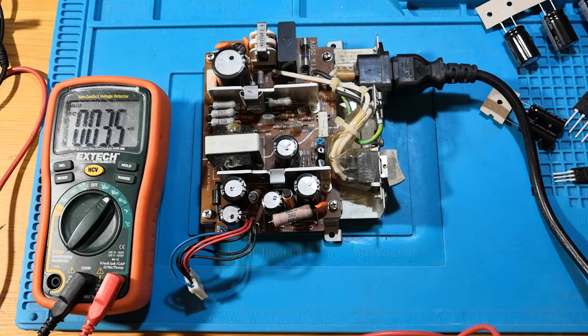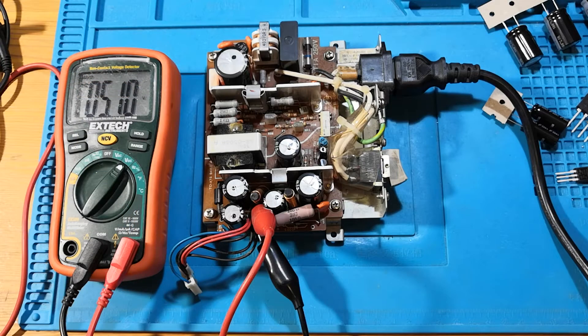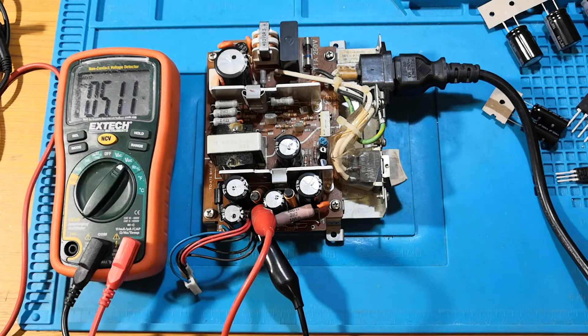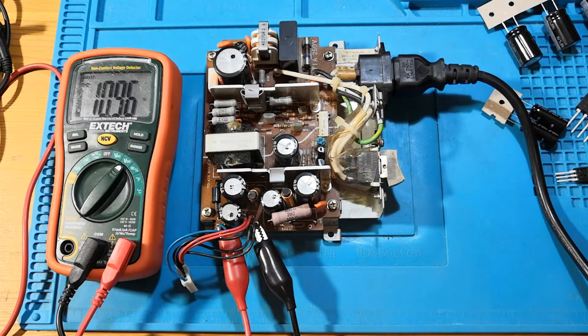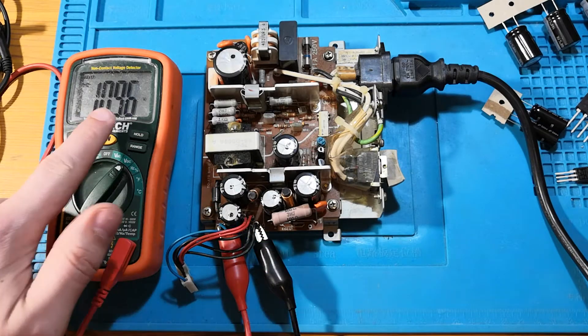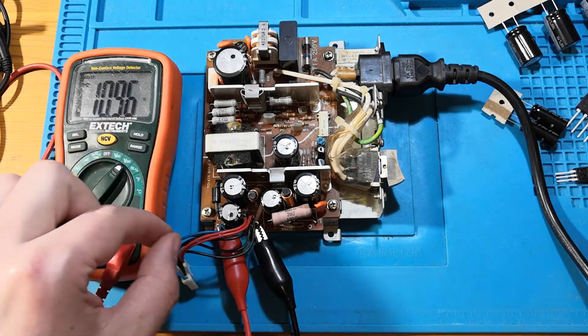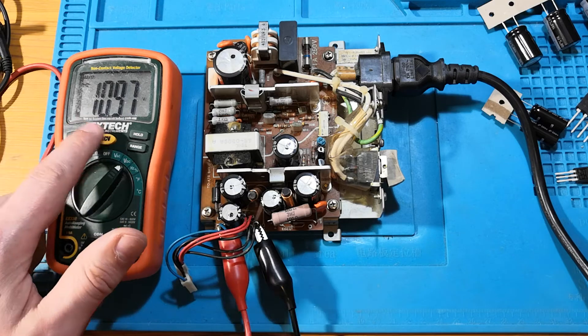Well, I guess that answers my initial question of does this even need recapping. I'm quite surprised it even worked, really. This is why you need to load your power supply down for testing. If you look, it says 5.1 volts on the 5 volt rail, so you'd think that was fine. And if we just test the 12 volt again — okay, so actually this shows you that something dodgy is going on. This is supposed to be 12 volts, it's not even loaded with anything, and it says 10.9. So yeah, this power supply is a bit dead.